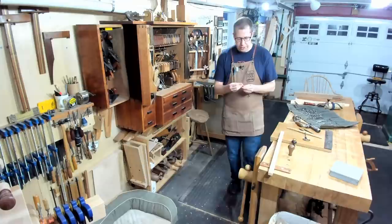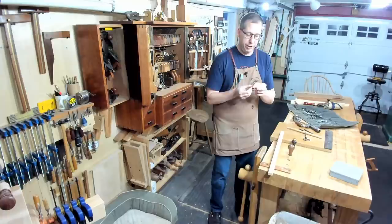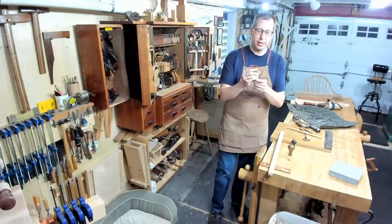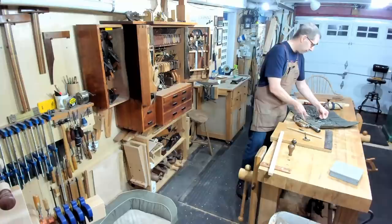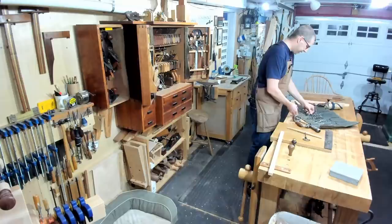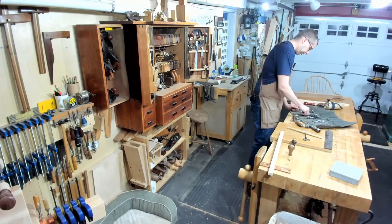The exit hole is clean because of the way the flutes cut. So again it's an oddity with hyper-specific uses that you may not run into in day-to-day cabinet making, but when it comes to Windsor chairs or boring at weird angles these things are awesome. They're not too hard to sharpen - you need a fine chainsaw file that you can get into the flute. The key is keeping that point really sharp, which can be worked with any kind of file, creating a conical point. As long as that is really sharp the rest usually cuts pretty well.